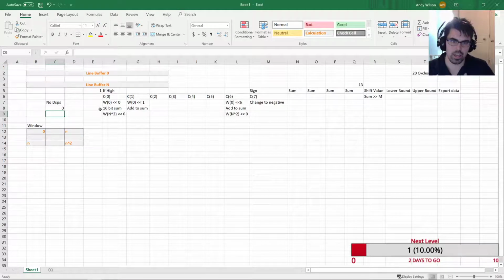And we can also parameterize it so that the latency may increase. This may be depending upon how we can do our addition tree of a set amount of values. But we could potentially add that into a block structure where it increases the amount of stages that exist. That'd be an interesting thing to have, kind of variable latency based upon the parameter of the kernel. So yeah, I think we could definitely have a good 20 cycles for a 3x3, and then we could do something else.